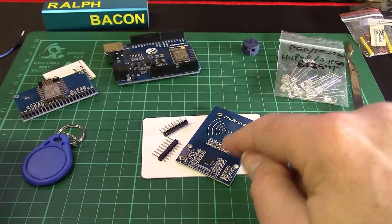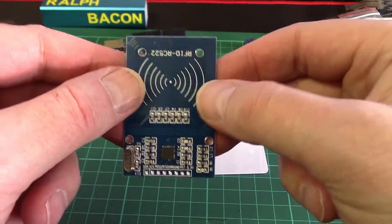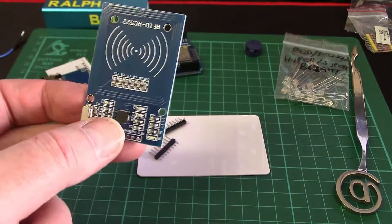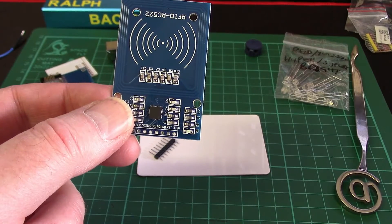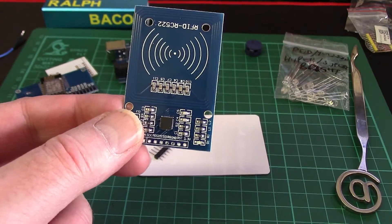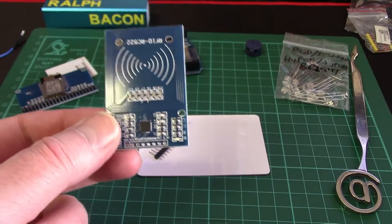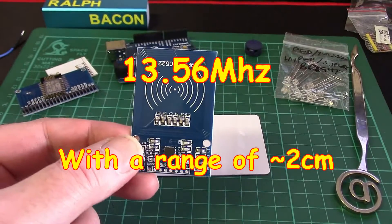I also want to get this RFID reader running. One thing you have to know is that this is a Mifare-type reader. It doesn't actually state the frequency on it, but I know it's several megahertz. In fact there are three frequencies used for RFIDs: there's low frequency at around 135 kilohertz used in industrial applications, and then this one which is 13.56 megahertz.